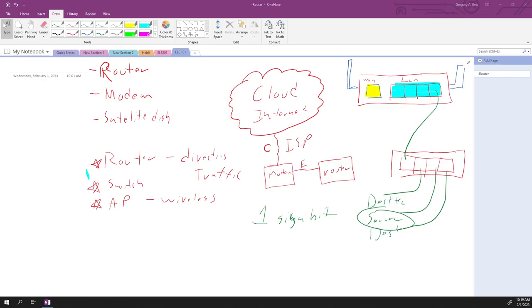Where you do need that higher network speed — that 1 gig — is when you have dedicated access points or a server where multiple devices are sending lots of traffic on a single run. In my office, I've got my desktop, my server, and maybe a laptop all sharing that one Ethernet cable back to the network. So having higher network speed is important because they all share that bandwidth.